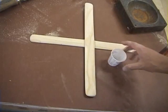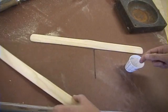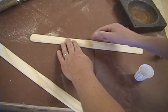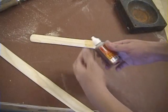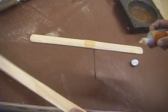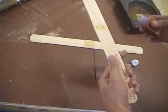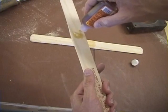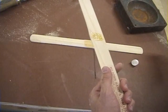I have here a small cup of water. I'm going to put just a little bit of water on one of them — you don't want a lot, just a little bit, just to make it damp. Then I'm going to take the glue and put it on the other one. You don't need a lot of glue because this glue will actually foam up to be two to three times more than what you put on. If you put on a lot it will foam up and end up being too much.